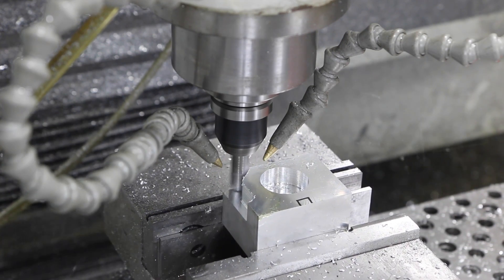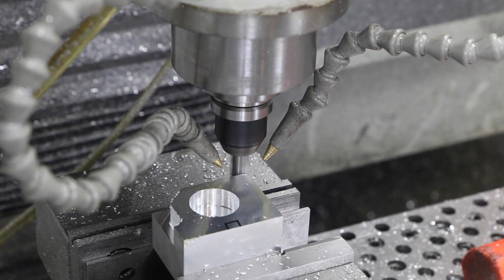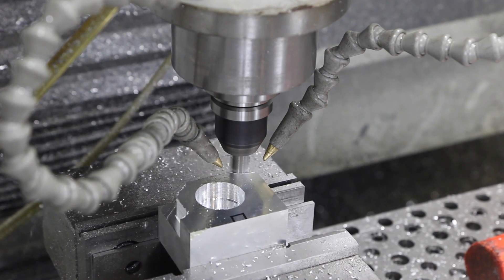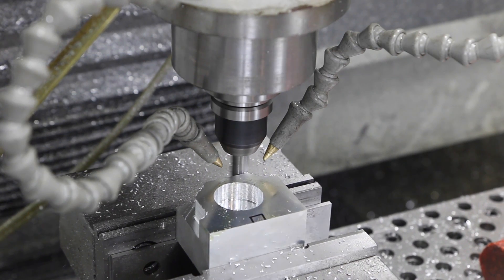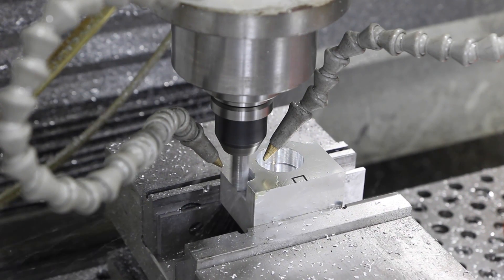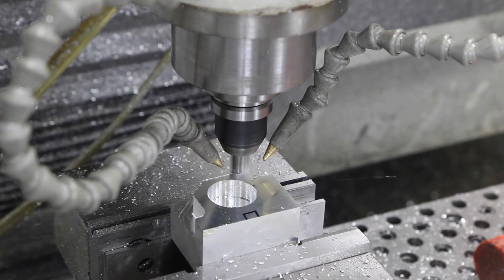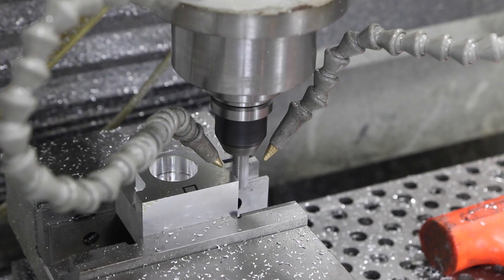One of the reasons I bought the Trico unit when I first got the Tormach was that I knew I wouldn't use it for some periods of time — maybe a week or two weeks. With flood coolant, the water evaporates, you need to remix and measure it, it can become pretty nasty if it sits, cause rust, or eat off the paint. I want to walk down, turn the machine on, and use it without worrying about any of that.